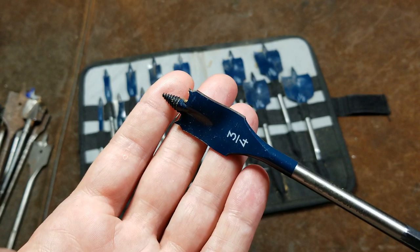Overall, they're really good — pretty much the best you can get. I looked at a few YouTube videos complaining about tools dropping various bits, including these Bosch Daredevils. I've measured all of these and they measure 248.5 thousandths, or 6.32 millimeters. They are absolutely spot on on the shanks — perfectly within any quarter-inch specification.